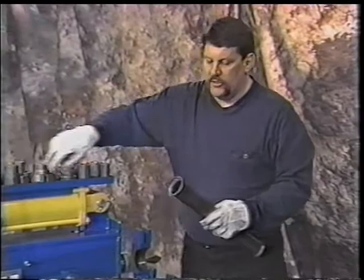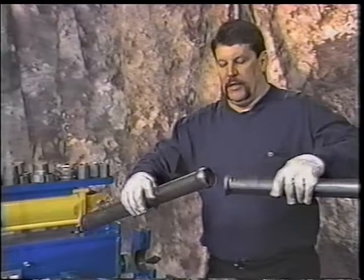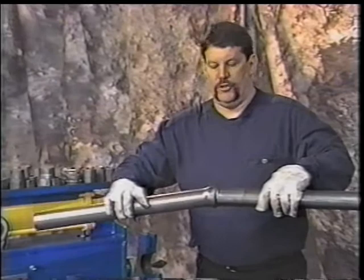To show you what this flare has done, as we've made the male before, this will usually be a coupling to where you use 2 flanges, and these will pull together, allowing a flexible joint and a detachable joint that'll seal up very, very well. Because of the expert design and tooling, it seals perfect.